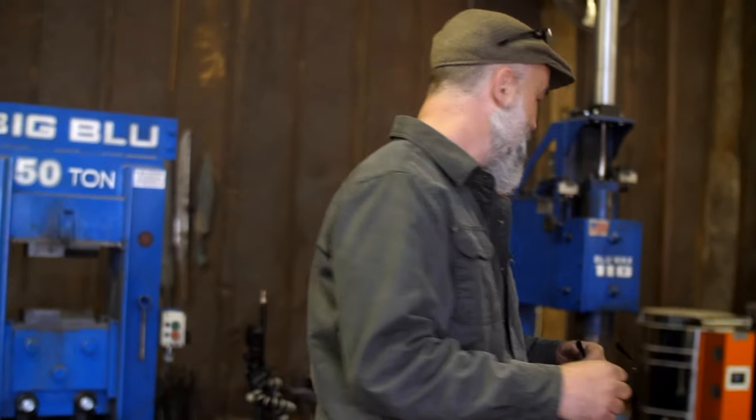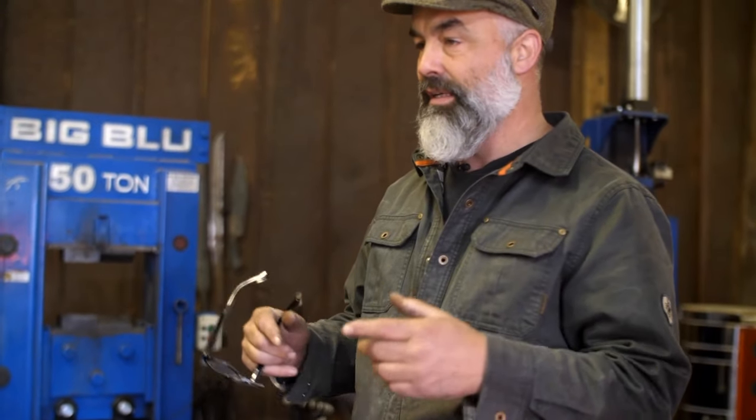Now this is a cool thing. Doing these loaves, one of the problems with them is if you don't kind of massage them, like work them down really nice and easy, they might want to tear. But one of the ways to keep them from tearing is normalize them and weld banding around them. This is a process that takes a while and sometimes it's kind of boring to watch. So what I'm gonna do is weld around, not the ends, the top and the bottom are the ends, that's the pattern reveal. Everything else is just junk, we don't care about that. So I'm gonna weld all the way around them and then we're gonna throw them in the forge and normalize them.